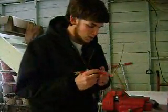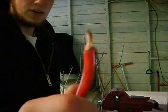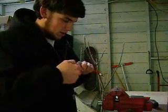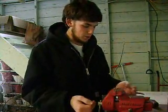Nothing — it pulls right out, because all it does is smash the wire flat. Unlike the professional crimp, which puts a dimple in it and holds it in there pretty tight. If you crimp it like I did, you just get a flat wire. It did take some pressure and pulling power for me to get it out, but I was still able to pull it out fairly easily compared to the other one.